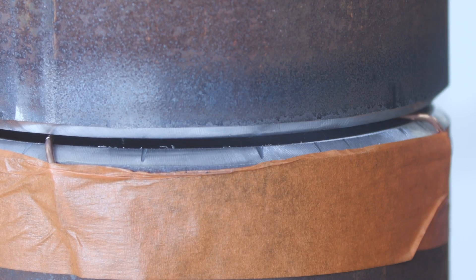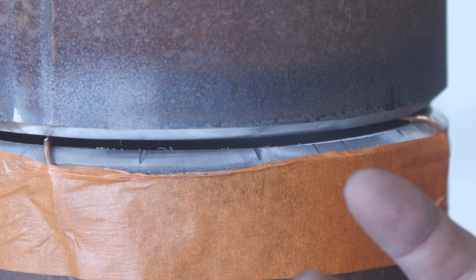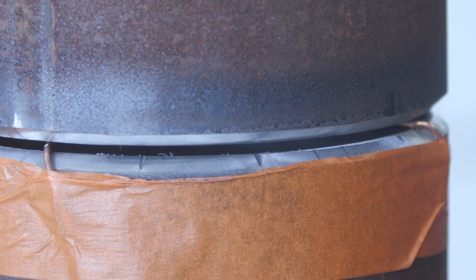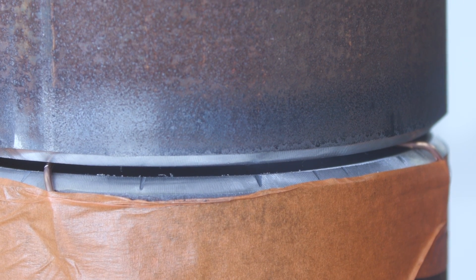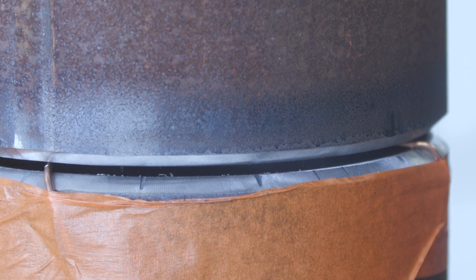I'm going to put four tacks — I'm going to quarter it, equal-size quarter tacks. They're going to be about three-eighths long, give or take an eighth. I want them a little longer even if they're specified a quarter-inch. If I make them three-eighths or a half-inch, I can ramp them in and out preparing for my root pass. If I just make them a quarter-inch as per procedure, I don't have a whole lot of meat there to manipulate for tie-ins.